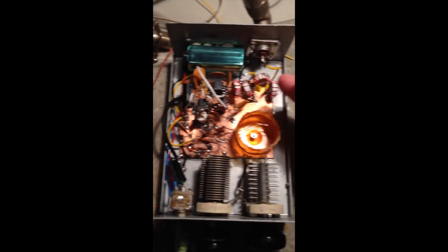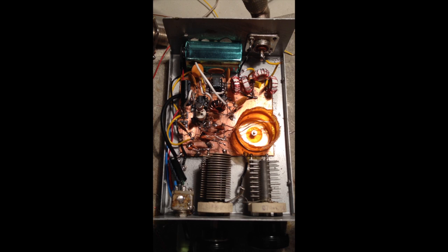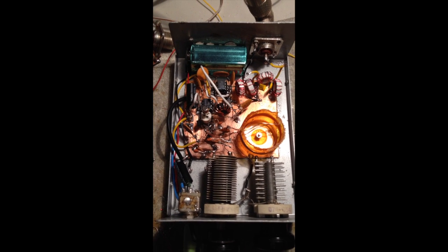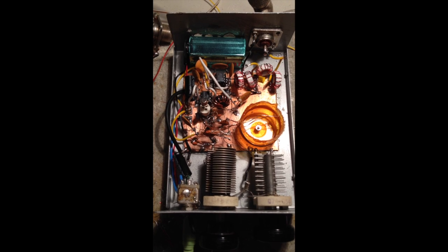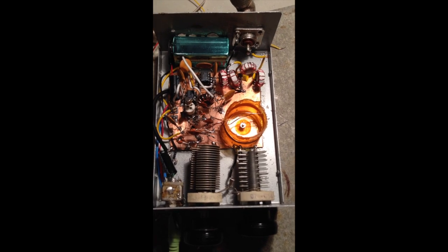I did some bandpass filtering because I've noticed with this circuit in the past that if you don't filter coming in from the antenna it really seems to perform fairly poorly in terms of selectivity — or maybe it's more of a sensitivity issue, really. The signals are just kind of weak and it just didn't perform all that well.